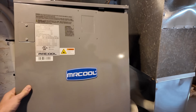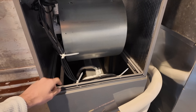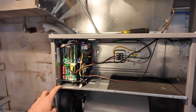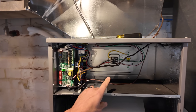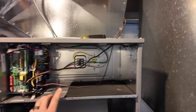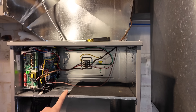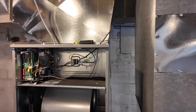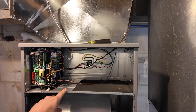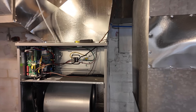This unit has a disconnect inside — it's a 15-amp 240V for the indoor unit, and then a 240V 50-amp circuit for the 36,000 BTU outdoor portion. Inside you have your evaporator coil and blower fan. One thing to note: there's an additional spot for a heat kit — you can add basically an industrial hairdryer ranging from 5 kilowatts up to 20 kilowatts. For this installation and test, there's no additional heat kit — it's just leveraging the heat pump.